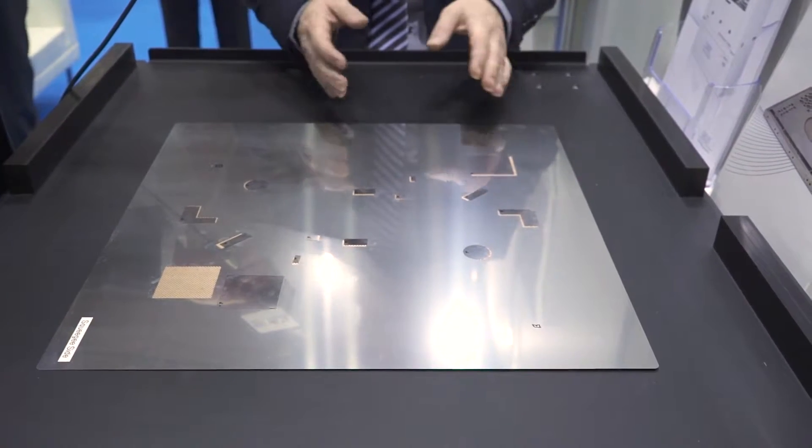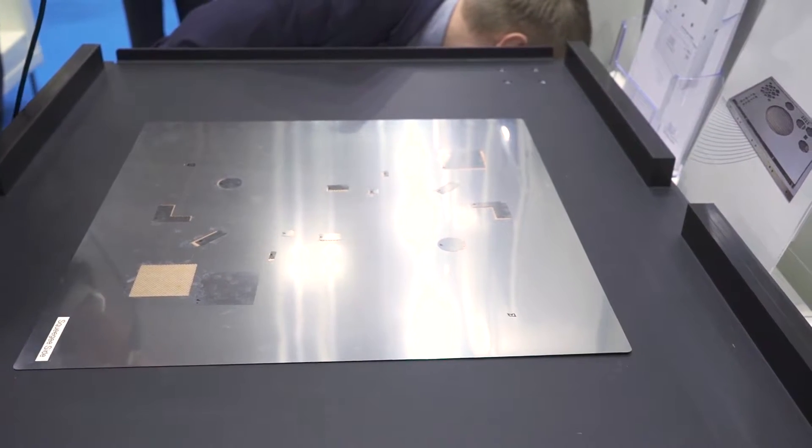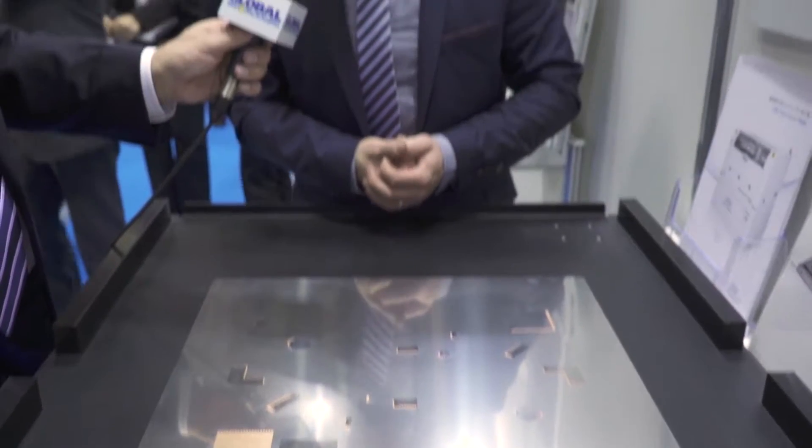Let me show how to set in the patches to the base stencil. I need to switch on the vacuum — using a standard vacuum system here. The low pressure is generated by an ejector, so you don't need to buy a vacuum pump, which has higher investment cost and maintenance. The ejector also features an air-saving module that shuts off operation as soon as the vacuum is stable, so compressed air consumption is reduced drastically.